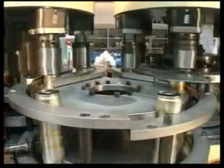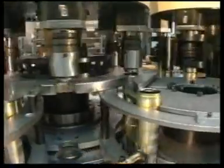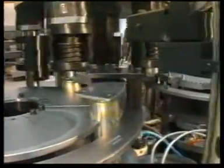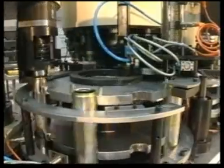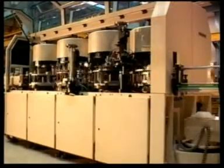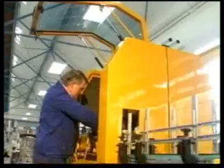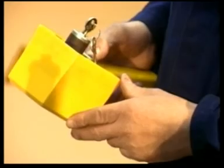Special versions of the Gamma are also available, featuring 2 different sets of tools with 6 stations each. This reduces resetting time, as resetting is then limited to just changing intake assignment and replacing the form-dependent guideway and positioning components. The machine's safety features naturally correspond to international standards. A handheld operating unit makes adjusting the machine even easier.